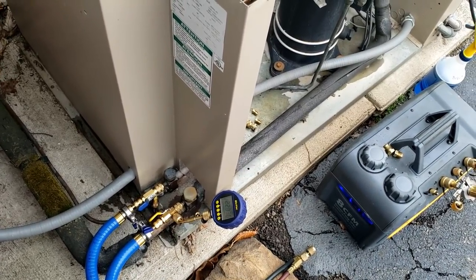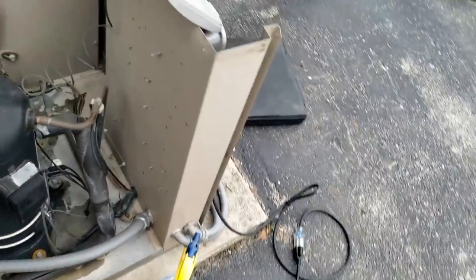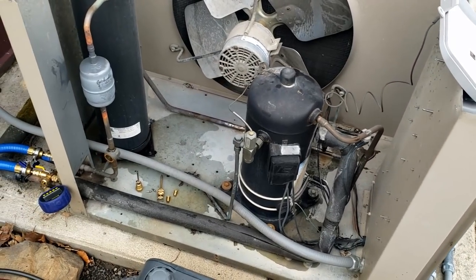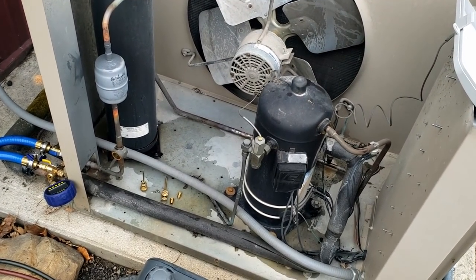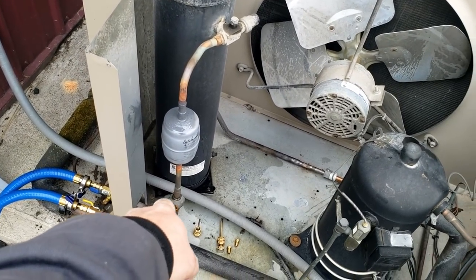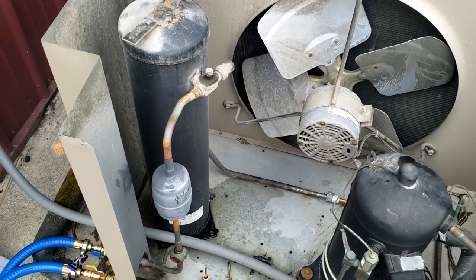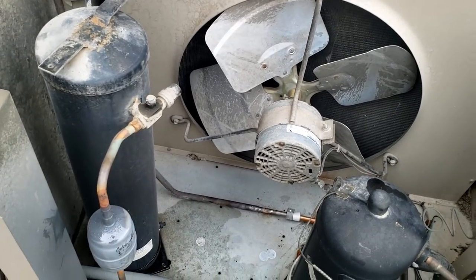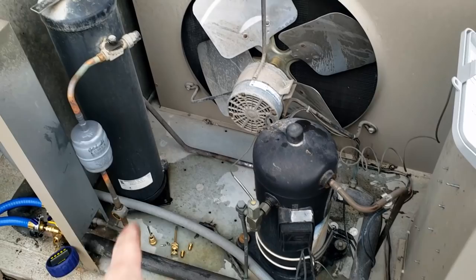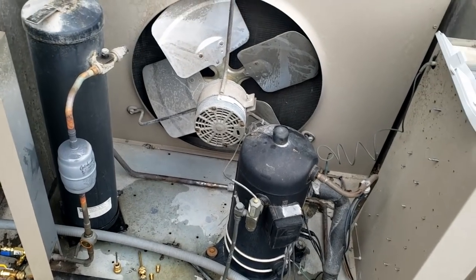I'm not going to spend all day trying for the perfect vacuum. It had a green indicator and hadn't gone into negative pressure because the pressure switch cut it out. When I was brazing on the filter dryer I was able to purge through the receiver, went ahead and put some oil on the threads, got it all back together, and tightened the packing nut on the valve.